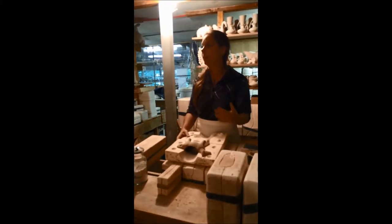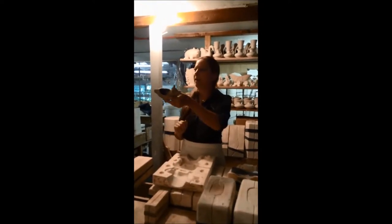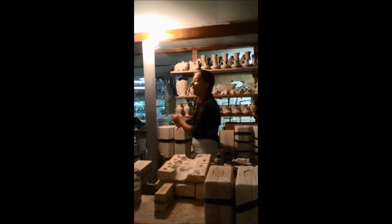When I open this mold, it's a little bit different. All the other molds I've shown you so far have two parts — a top and bottom or a front and back. This mold has a third piece so she can have standing legs. Without that third piece, she would not be able to get the undercut for her legs and would have to be a laying-down cow. The next step is to clean out her tail, drill a hole in her mouth, get her all painted and glazed, and she will become our little cow creamer. We don't know the secret to the little cow's success, but she has been sold here for over 50 years. The lady who painted cows just retired maybe three or four years ago at the ripe old age of 92 — she painted cows until she was 92 and autographed every one of them along the way.